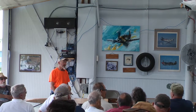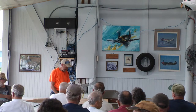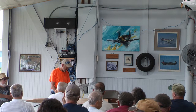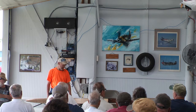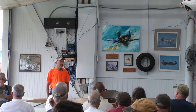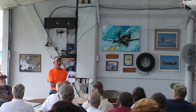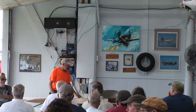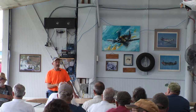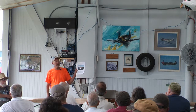I referenced that. And then you had some comments on this about where you alternate the heavy end of the board. Good idea. There are other publications about propeller making. I think the one you're talking about is a fellow named Eric Clutton. He published a book called Propeller Making for the Amateur. I've read it. It's a small book, and it's got more theory, a lot of mathematical theory. What I have here is more nuts and bolts, geared toward a craftsman or home builder who has the ability to gather the anecdotal information you need, as far as diameter and pitch, from other people. If you know what diameter and pitch of propeller you need for your home build, and you read this and follow it, you should be able to carve the propeller.